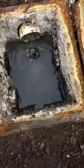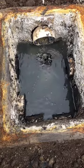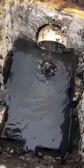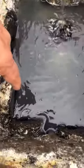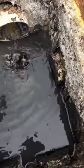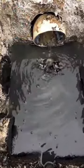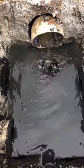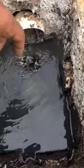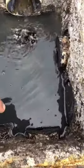The problem with these distribution boxes is that we have to be very aware that any micro shift — whether it be a couple of millimeters here or there in the field piping — can really affect the amount of flow going into each channel. We want to make sure the maintenance provider checks your distribution box while pumping out at minimum, and at the very minimum this needs to be checked every couple of years to ensure speed levelers are working properly and each trench section is receiving the same amount of flow.